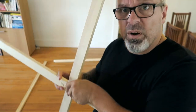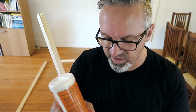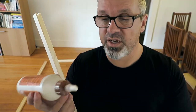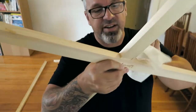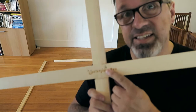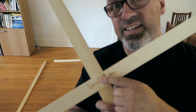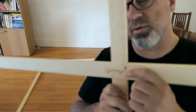The whole point of the screw is to get it into the wood. With the wood glue, it's important to understand you don't need a lot - you don't want it squishing out all over the place. You just need a little bit for support. That's probably even too much - I might even wipe some of that away. Simple woodworker lesson: you don't need to go nuts. You just need to get it past that countersunk hole - the little dippy hole thing - just enough to secure it on both sides.